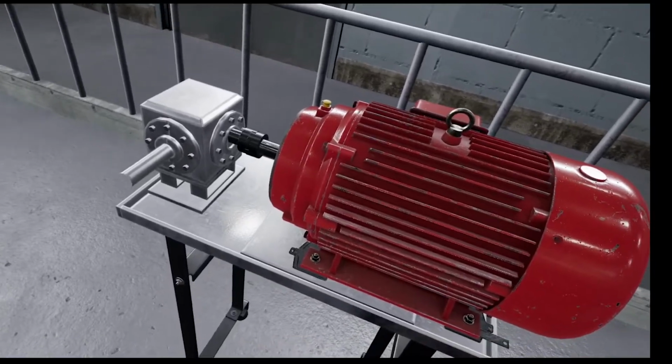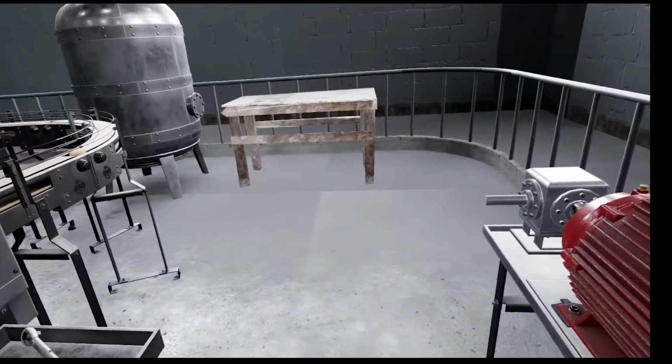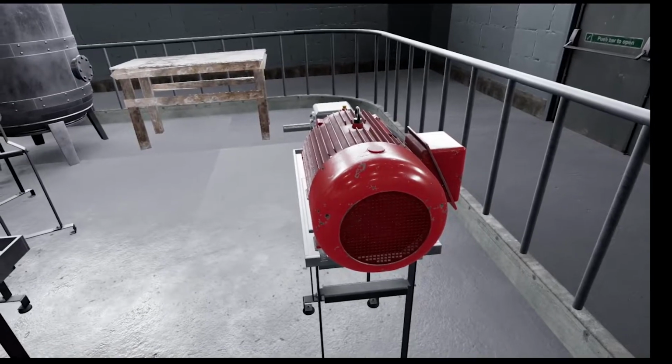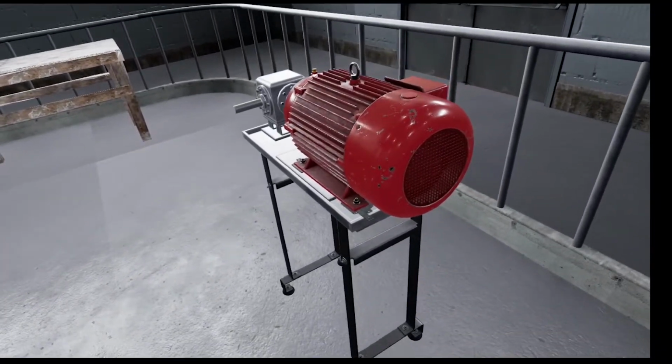Nice. Now correct the soft foot on the other motor by repeating this process. The soft foot on the other motor may be a different thickness. To correct it, add a shim under the foot that is the same thickness as the gap that was just measured.